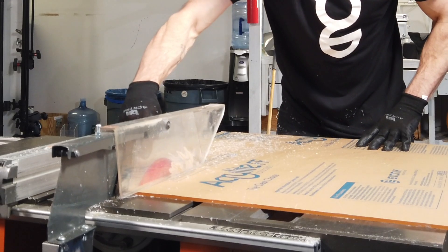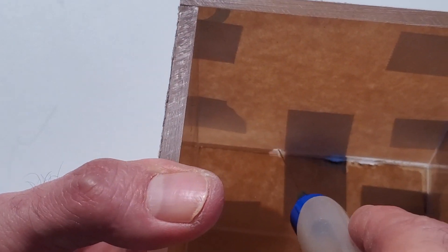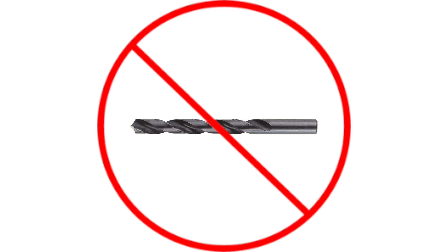It's workable. With the right tools you can get clean, smooth cuts. But my favorite thing about it is how easy it is to join it to itself, and we'll show you how in just a little bit. Let's talk about what tools are good for working with plexi. You don't want to use a spiral bit for drilling holes — a step bit works much better. However, sometimes if you have to, you can use a spiral bit with thicker pieces of plexi. Keep in mind, plexi doesn't like to get hot, so if you're cutting or drilling, you want to make sure that whatever debris comes off your cutting area gets clear of your work and doesn't sit there rubbing up against it, getting hotter and hotter. It will tend to gum up, and if it does, it's really not going to turn out very well. Sometimes I use water to keep things cool.